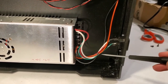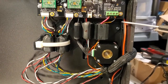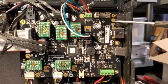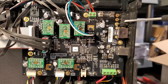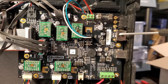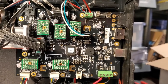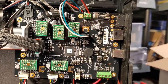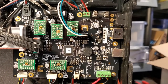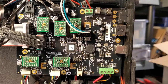Looking at where the 24-volt wiring goes — it goes up, goes back here, goes under the board, and is actually soldered on. The 24 volts is soldered on the bottom side of this PCB board to the switch, and the ground is soldered onto a ground pad on the original connector plug for the board. If you have any electrical experience, it should be pretty easy to figure out which is which. Unfortunately, I don't want to take the board back off for this video.